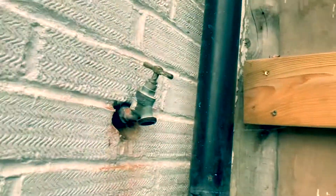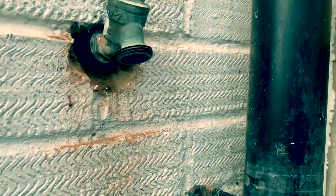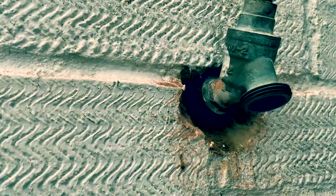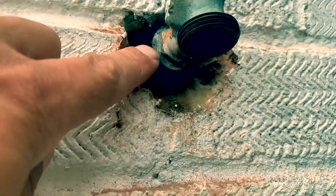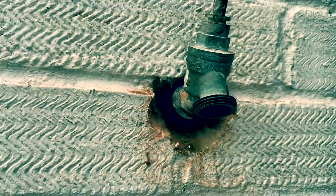It's really easy to drill away at the bricks with that masonry drill, and now I've got in I can see there's a nut here which I think is about 22 millimetres. I need a spanner that can hold that, and then I twist this nut here with another spanner and it'll get the tap off.